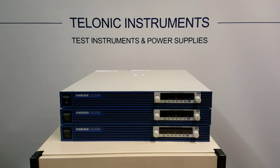They have other voltages in their range — there is a 30V unit, a 230V unit, and a 650V unit as well. What we are going to show you today is how to use these units in a master-slave configuration, and turn these three units here into just one single 4500W power supply.